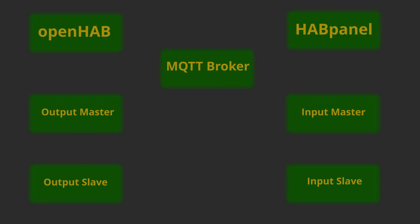Now I will quickly give you an idea which way the information and data will flow in my system. Starting from boot, all the lights are turned off. Firstly, the slave boards: after boot and before any lights are controlled, they let the master know that boot was successful and they are ready to receive commands. The master acknowledges that and publishes an MQTT message saying that the system is good to go. The message goes through the MQTT broker to OpenHAB. An OK flag is then set and the system is online.